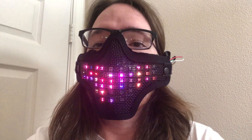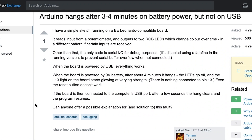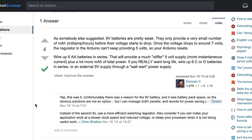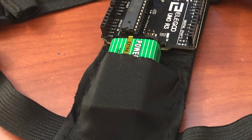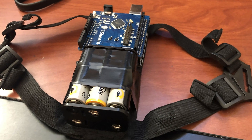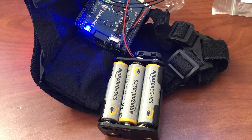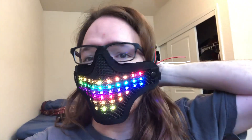I suddenly began running into a weird problem. Sometimes, when I played more complicated light patterns, the program would crash and the lights would get stuck. After some searching online, I figured it out. Apparently, 9-volt batteries are not the greatest for consistent power — their voltage tends to drop after a while. If the voltage drops below 5 volts, the Arduino can't sustain the program, and using the more power-intensive designs was making that happen faster. To fix this, I swapped out the 9-volt battery for six AA batteries in series. Six AA batteries supply the same voltage as a 9-volt battery but with a more consistent current. I made sure to buy a case with the same power adapter as the 9-volt battery for simplicity's sake. After making this switch, it worked perfectly. It became a little heavier and hard to keep on my head, but some adjustments to the strap tightness took care of that.